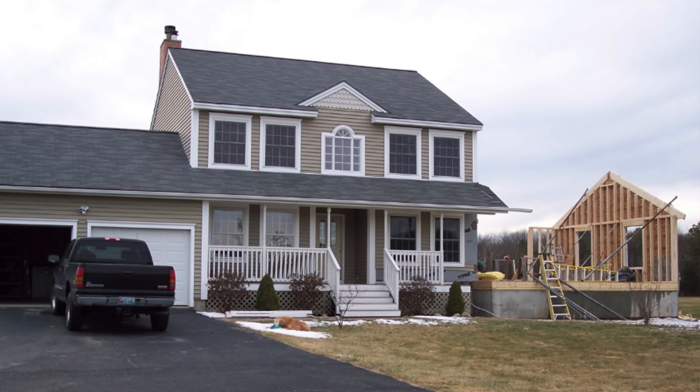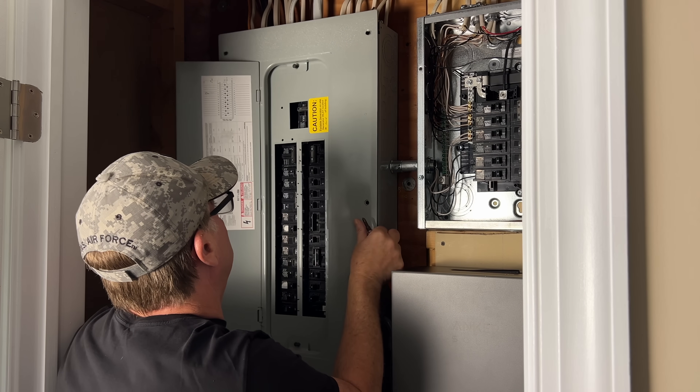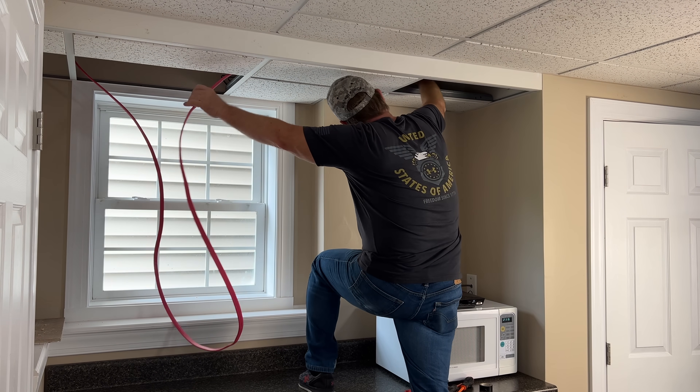The fourth common place to find unused wires is in junction boxes — maybe up in the attic, out in the garage, or down in the basement. When I wired my house 25 years ago, I carried a spare 20-amp circuit up to the attic and another one out to the garage, because these areas don't have easy access to my electrical panel which is located in the basement. This isn't a code requirement, but it can save a lot of work if you need a circuit later on that wasn't part of the original plan. I have them labeled in the panel and in the junction boxes to make them easy to find and use in the future. There are a lot of other possibilities for those unused wires, especially in older homes that have been renovated a few times, and it can be difficult to figure out where they all go.